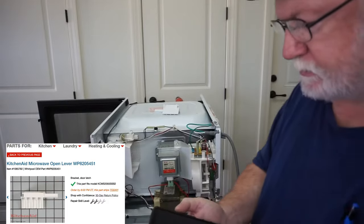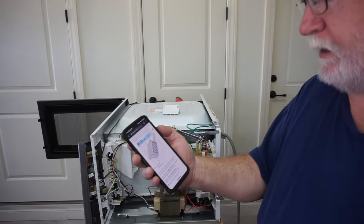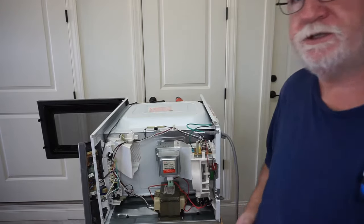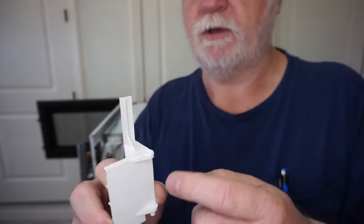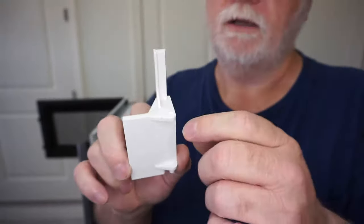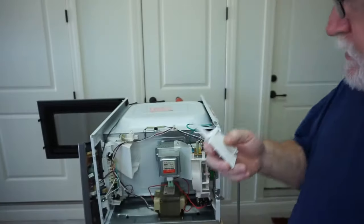This is the 22nd of September and it's going to take until the 28th to get them. So I'm going to go ahead and order them. But in the meantime, I'm going to take this unit right here and drill through this axle stub, thread this part, epoxy that stub on, then countersink the screw head into that stub, and reinstall this until the new part comes in.